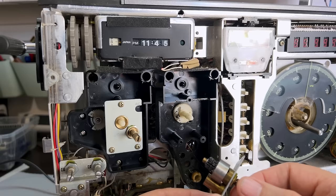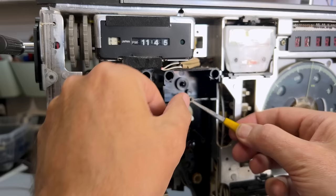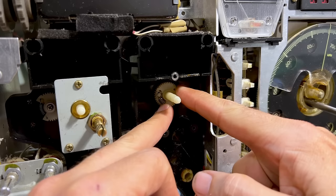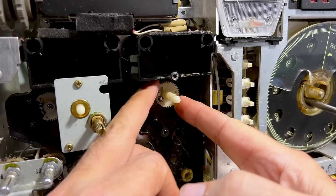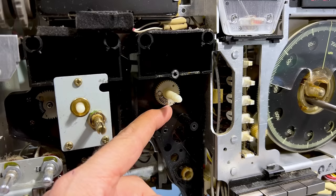That one's already done, and this one I'm going to do now because I had forgotten to put this little washer in there. That's why you forget these things - they jump everywhere. This is where things get tricky. You have to rotate this gear until you are aligned with the other one on the inside. There's a hole at the top here - you've got to see through it. I discovered I can actually put my finger down here, twist it to the max, and it's in there.